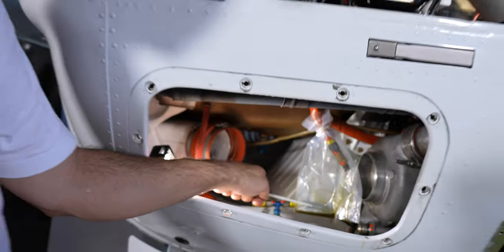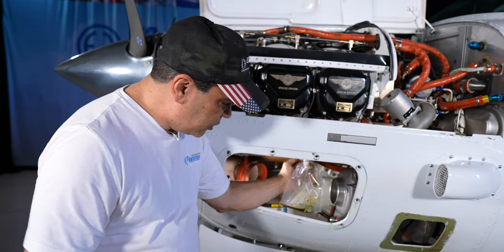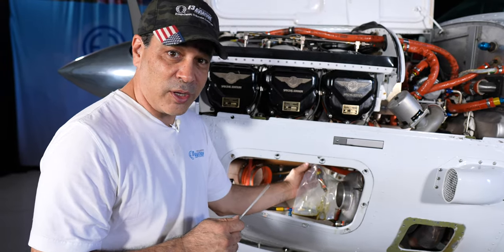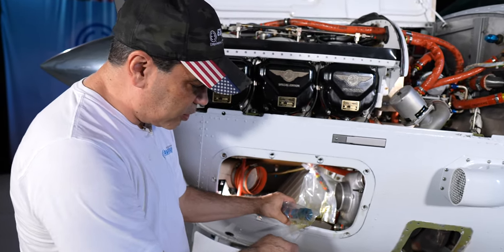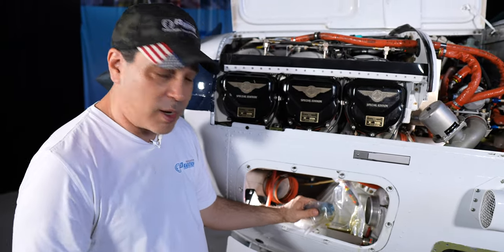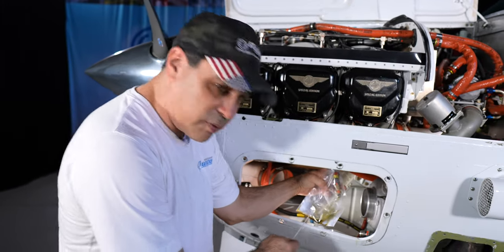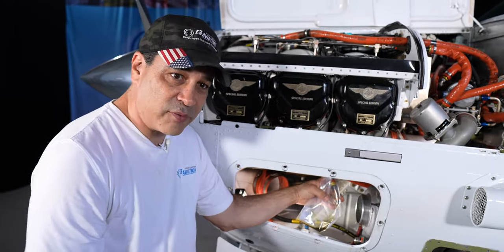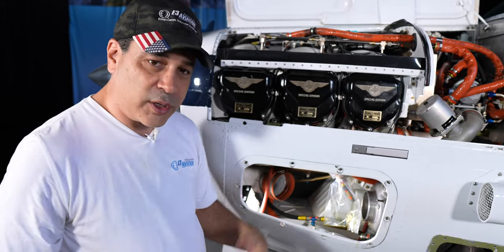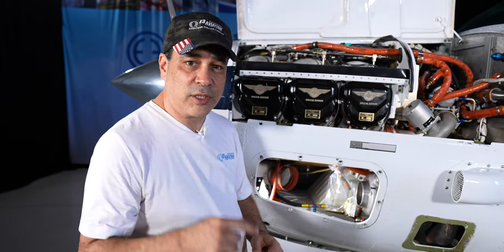You can see all the oil is in the bottom bag of the top check valve. We waited about two hours and clearly it's the top check valve that is the problem — which is good because that's the cheaper one at only 300 dollars. Here's the bottom one: there's very little in it, just residual from when we took it off, so that one is not a problem. That's the expensive one at 1500 dollars. The new part is coming in overnight via FedEx, and we'll get that changed out. Small problem, quick fix.